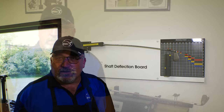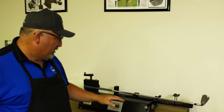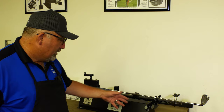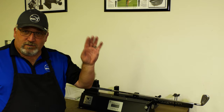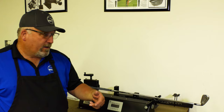Now let's see how we do it digitally. We went from the deflection board — now we're into digital. Two different concepts: we're hanging a weight and seeing deflection, versus this digital deflection with a different holder. This is the new model. When you see me in my shop, I have the old variety, easily 20 years old. They've done improvements for the way it hits — the way that they will twang it. When you have these jaws, you twang in the direction of the clamp. I've seen guys try to throw it sideways and pull it out of the clamp and wonder why. Don't do that.